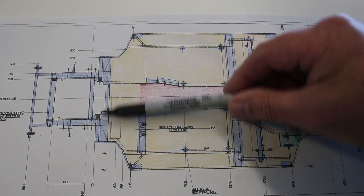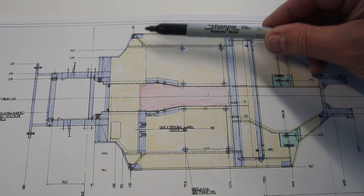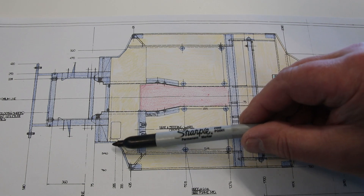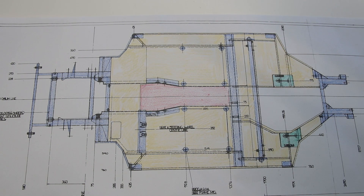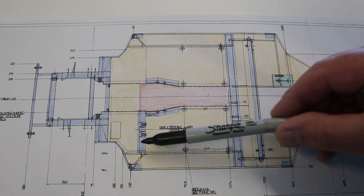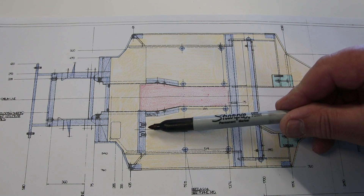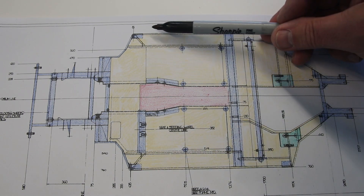These parts were really badly damaged — the front extension was fairly badly damaged and corroded — but we want to get all of this structure the right shape and strong so we can use its strength while we repair the honeycomb. This is a left-hand drive car and that hole is where the pedal box goes through, but on production cars there was also one on the other side because the theory was you could convert at any time from left-hand drive to right-hand drive. The steering column is mounted on a fabricated steel item that slots on with a few bolts and can go on either side, though it ended up having to be offset so you need an opposite-handed one to convert. These are the jacking points, which were later extended outwards so you could put the car on stands.